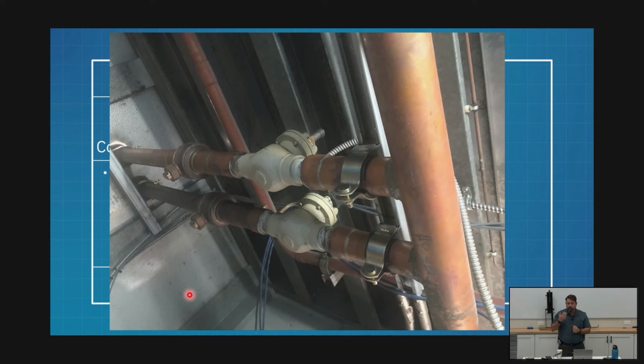So there are two takeaways from this. We're using normally open solenoids. And one of them doesn't have a coil because that's the one that's on all the time, and I have to balance my pressures. They're not interchangeable. Not interchangeable.